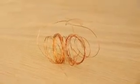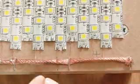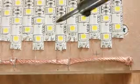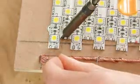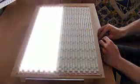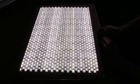Now it's time to connect the strips to the large wires we added earlier. What you'll need for this is some magnet wire, also called enameled wire. You can of course use normal insulated wire, but it's much more time consuming as you'll have to manually remove the insulation as you go. On the left side of the panel, solder this magnet wire to each of the positive marked contacts on the strips. As you go along, trim the magnet wire at the point where it passes over the thick wire, then solder the trimmed ends to this thick wire. After you've finished the left side, move around to the right side and follow the same procedure, but this time using the negative marked contacts on the strips. Once you've finished, you may want to try hooking it up to a 12V power source to check for any loose connections — keep in mind that it may appear dim at this point unless you use a power brick capable of supplying at least 10A.